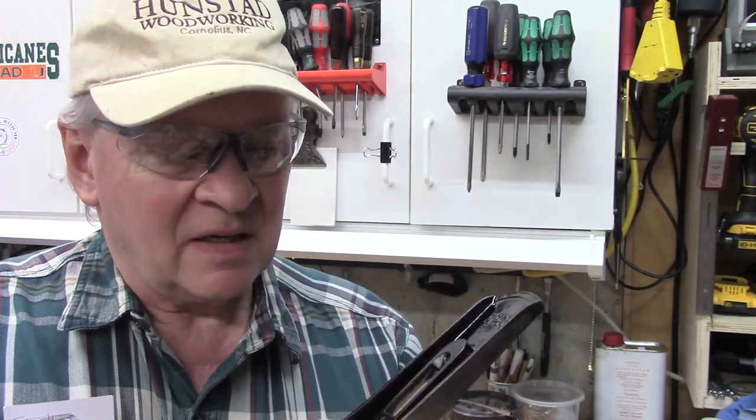It's nice and hard. It's dry. It's been baked. I baked it up to 400 degrees for an hour. And this really, really took well. Two coats of the japanning, and then we've got a truly authentic, beautiful coating on the inside of this, which is rust preventative. But now I've just got to clean up a little of the overlap here and a bit on the base, which I'll do, and also get back to these four machined points for the frog, and we'll put this baby back together and see how she does.